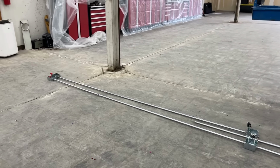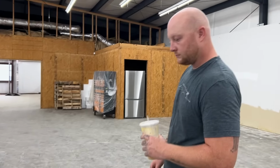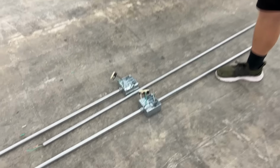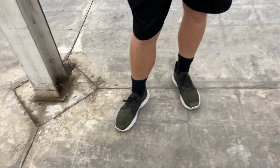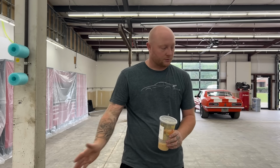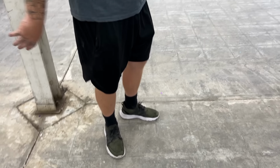So what we're doing is we're pre-making our conduit junction box plug-in boxes, and then we're gonna take it up in sections, because on the first one, we took it up as a whole piece. Yeah, that was a bad idea. But Dennis and I measured out where the lights are gonna be on the floor, and we marked them. First light's gonna be here, and then the second one down there, and the third row down there. So then we just put our boxes a couple inches offset, so that way the eyelets have room to drill through, but then we can just pre-make all this stuff up here instead of having to measure up there between boxes. Yeah, this actually lines up with those marks. Yeah, but we just shuffled it.